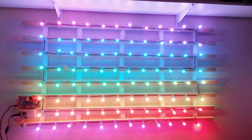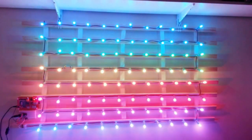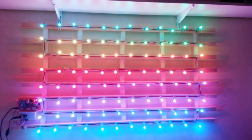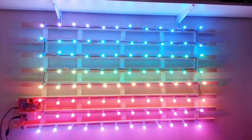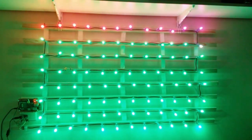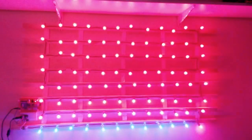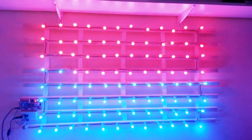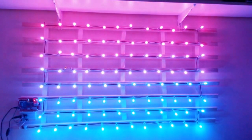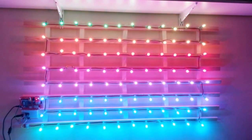I'm not trying to make a high resolution display, I'm trying to make a very cheap display. I've got two strings of 50 LEDs, though I'm only using 96 here — I chopped four off at the end. Each string cost me 12 quid from Amazon, shipped from China, so that's 24 quid, plus one of my older Raspberry Pis — I do have rather a lot of them. Level shifter chip from Adafruit, about three quid or so, and a 10 amp 5 volt power supply.